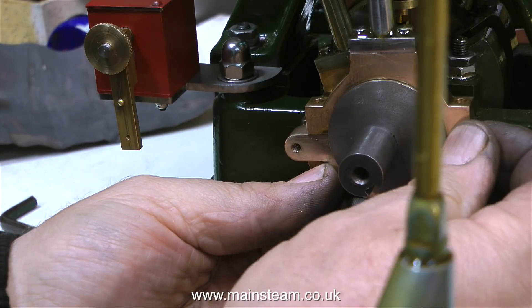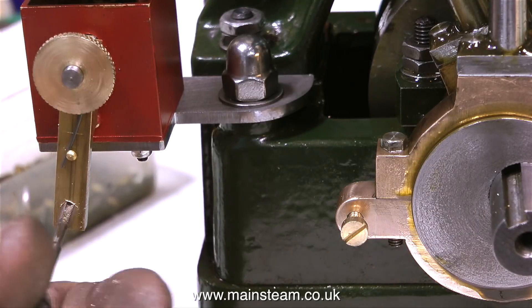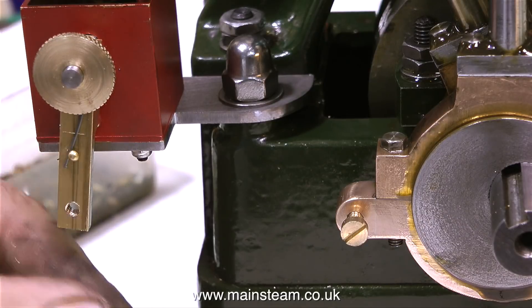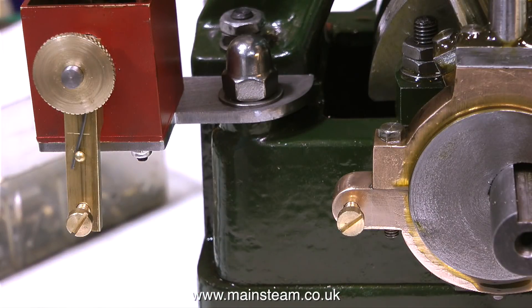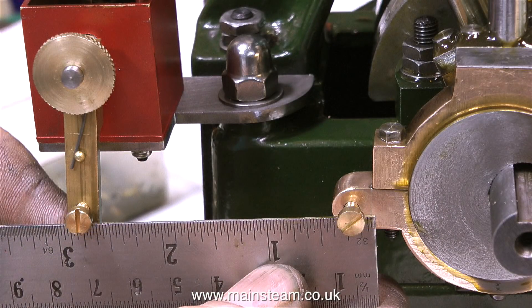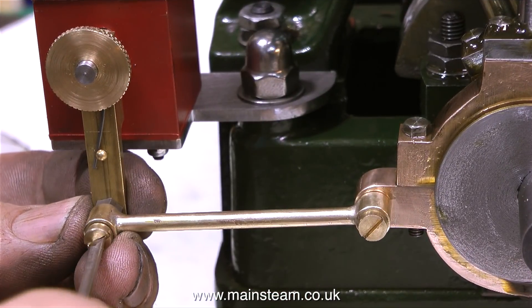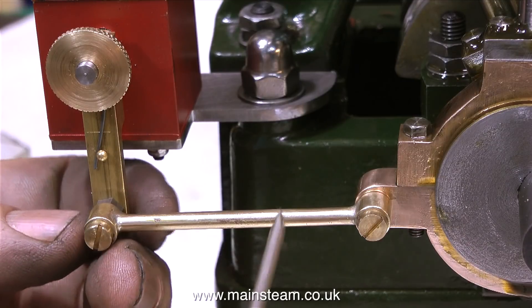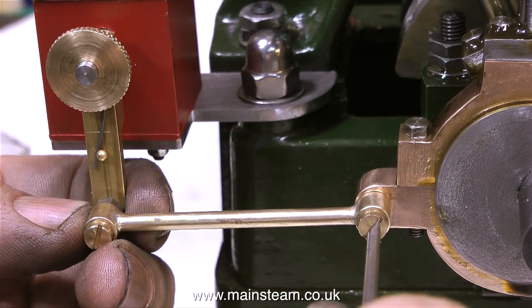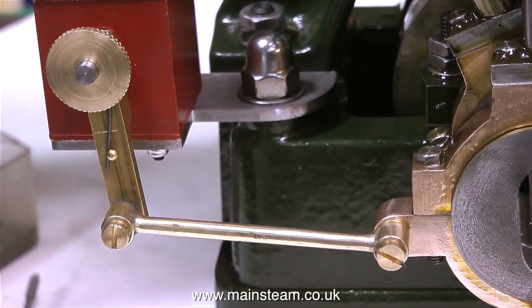After applying the usual copious amount of lubricating oil, I reassembled the eccentric — I won't show that as it was very boring. I also enlarged the hole in the arm on the lubricator, which is quite simple — I just drilled a bigger hole in it. Then I cut a thread in this hole with a 4BA tap, temporarily put two 4BA brass bolts in there, measured the distance between them and made this link. Links like this are really simple to make: you just machine two collars in the lathe, cross-drill a couple of holes 5/32 of an inch in diameter, and then silver solder the bar in, which is also 5/32 of an inch in diameter. Simple, effective, and more than strong enough to do this job.